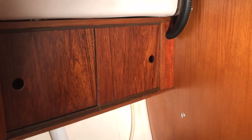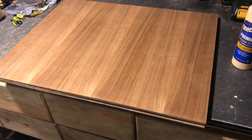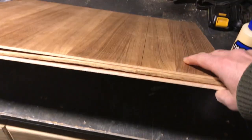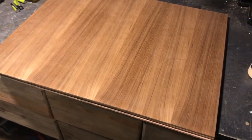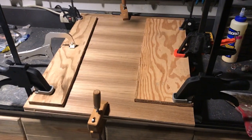Next I thought I'd take a look at the folding table. This wood is left over from the galley rebuild — I did buy extra for this purpose. What this is is two sheets of quarter-inch teak plywood, one on top and one on the bottom, and in the middle there's a sheet of quarter-inch oak plywood. I'm going to glue all these together — that should provide a very stiff board. Gluing it up now, clamped up.